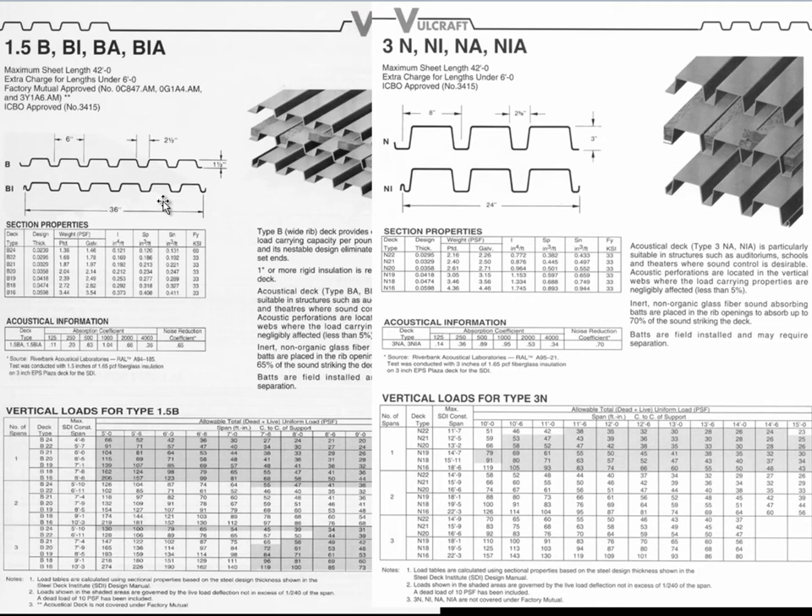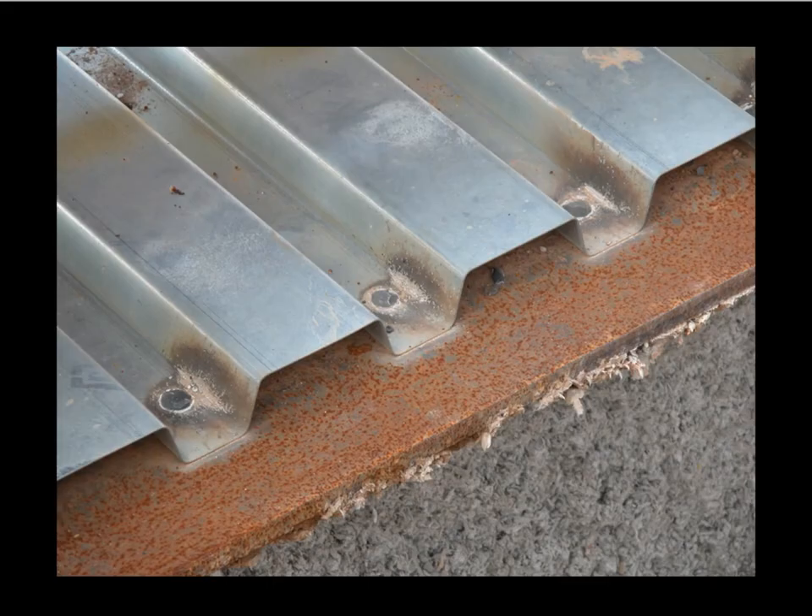You can also go to four and a half, six, seven and a half, and ten-inch deep corrugations. These are generally much more expensive and come in one-foot widths as opposed to three-foot widths, which tends to drive up the price. All corrugated decking almost always is used as a diaphragm, but whether it is or not, it has to be either welded or nailed to the top of the support structure.